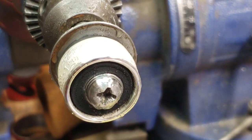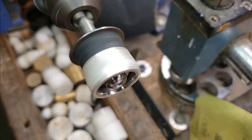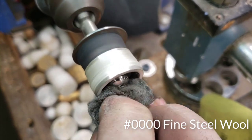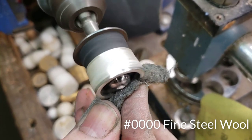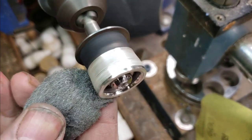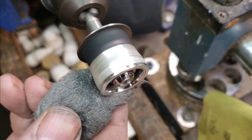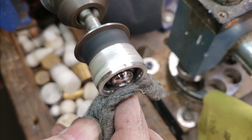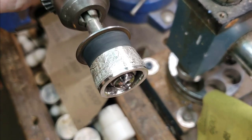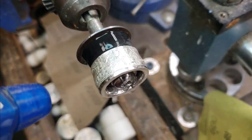Be sure to watch that you don't touch that ring right away — as you can see, it's really, really hot. Have some water standing by so you can cool it down and be able to handle it. Flipping the coin over, I can start working the inside. I'm working with some quadruple-ought fine steel wool — this will actually make it smooth; it will not scratch it. I use it for the top reed to get that really nice finish where the dies have made little scratches. When doing the detail on the ring itself, I'm just barely touching it — I don't want to lose any of that detail. But the reed right on the end is the only one I'm actually putting pressure on. With that, you're going to see just how much detail pops out.